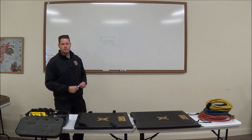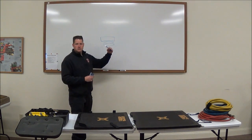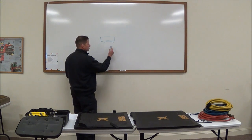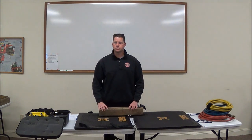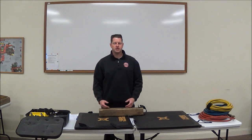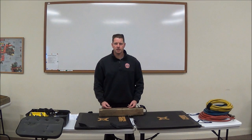In the end you really don't end up with much more lifting height from stacking. A much safer and more effective way is to use a single bag, lift as high as you can, crib the object, stabilize it, deflate the bag, and then build your cribbing stack under the airbag to gain additional height. As we're lifting our load, we need to crib it to stabilize it, because we never trust an airbag alone to stabilize an object. Anytime an object is supported by an airbag, we consider that unstable, so we must have a cribbing stack in place to support the load should anything go wrong.